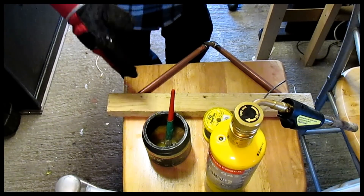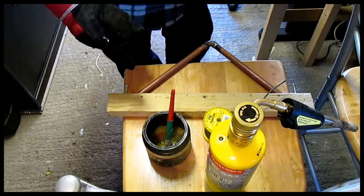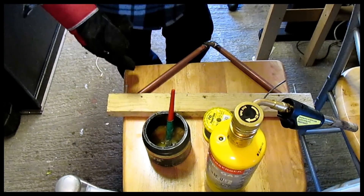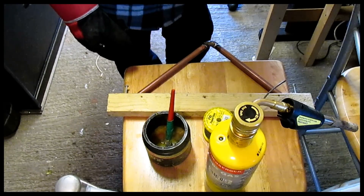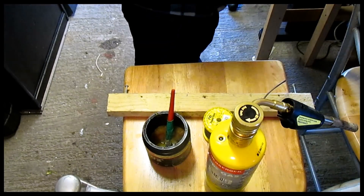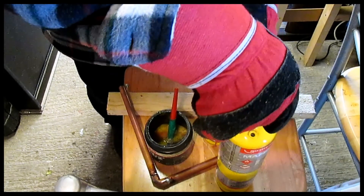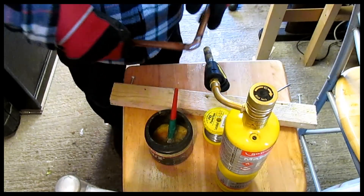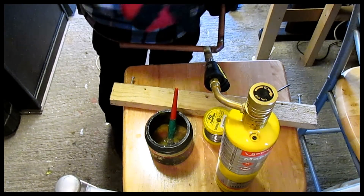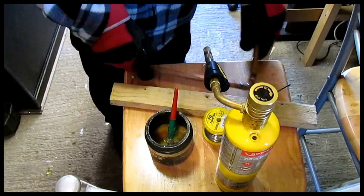If you cut it out with its pipework it means you're going to have to use a coupling on there, but at least you know this is going to be okay. Before we put that coupling, just make sure it's thoroughly dry inside the pipe, it's clean, you get the right amount of heat to it and a blob of solder and off you go. Now we've cut this out, we'll get the lamp going. If you use a hammer or any implement to hit it with, you're going to distort that joint or break the pipe — so it's a matter of twist and turn, twist and turn.